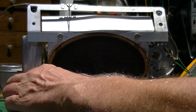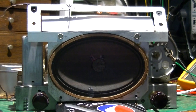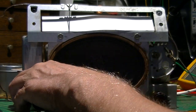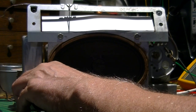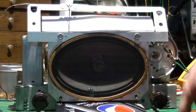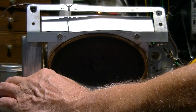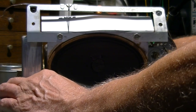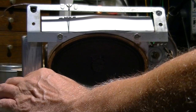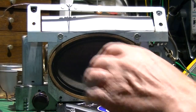The 7A8 octode converter-mixer had a lot to do with it, and cleaning this tuner as well. You'd think it would be the tuner because you go down to 900 kHz and then you start increasing the capacitance and you don't have it - you'd think it is the tuner. But it wasn't, because I had the good tube in there and it didn't help it. So I'm really happy that I got it going. Now I can start on another radio once I get this one back in the cabinet.